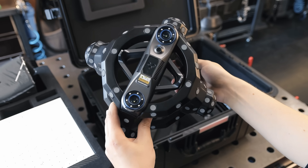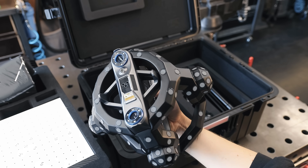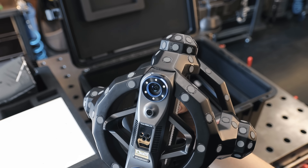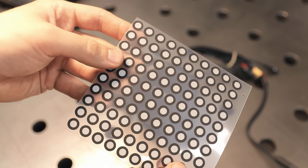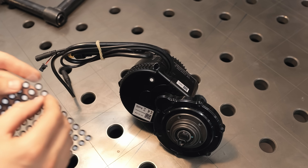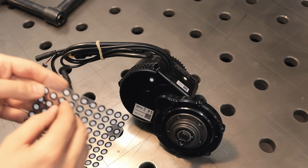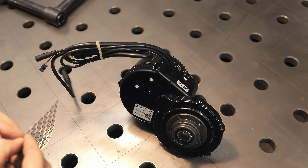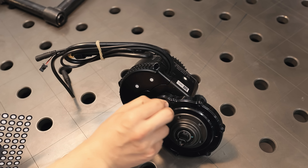That's also exactly what makes the Trackit so special, because it uses a very advanced tracking system that is usually only found in much more expensive professional models. Most scanners in the consumer or even in the semi-professional market rely on what's called markers on the object you want to scan, and those serve as reference points which allow the scanner to figure out where it is located in space in relation to the object. This is crucial to enable it to synchronize the data it's capturing with the data that's already been scanned, and this process is called tracking.